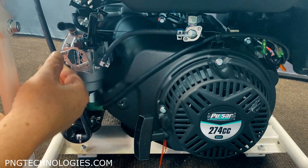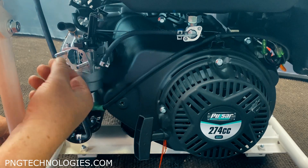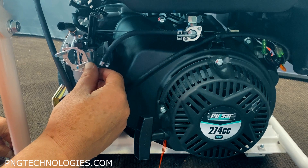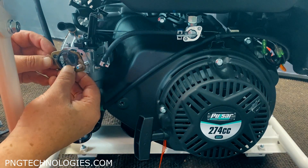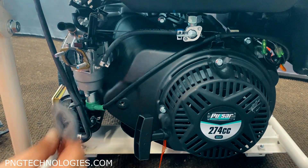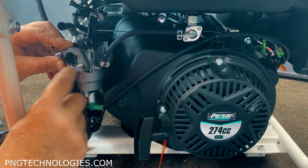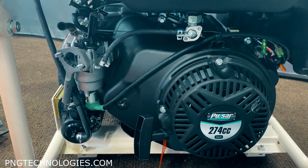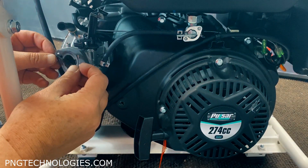What I do is take this metal bracket off - it's just a little intake gasket with a seal in it. You're going to lock down on these studs and turn them out on both sides until you have clearance to get everything back on. They're very easy to pull out - you can double nut it or use vice grips. Just make sure you grab back here so you don't narrow the threads. Get your metal gasket back on, put our adapter on, and it all lines up. The face matches, all your choke works, everything's good. We'll supply you a gasket.